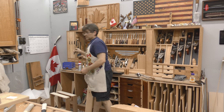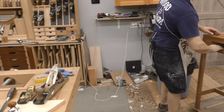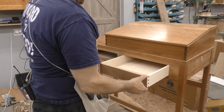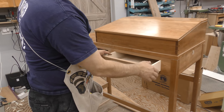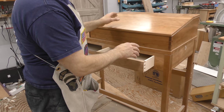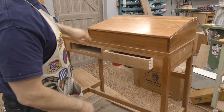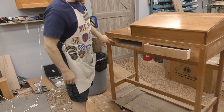I think I've shown you this before. My chisel plane to finish it off. Now, it doesn't have to be perfect back in there because by the time your drawer gets there, you've got enough contact along the side that if we lose some of that side-to-side contact in the back, you're not going to notice it. You're not going to start all of a sudden getting a loose-fitting drawer because we took a little too much material off that very back end. But I don't want to have to deal with that.